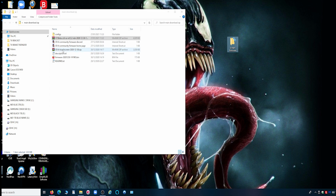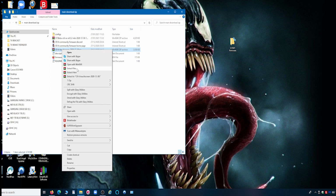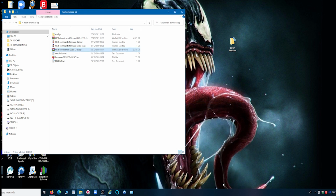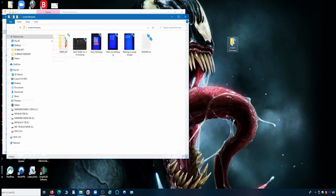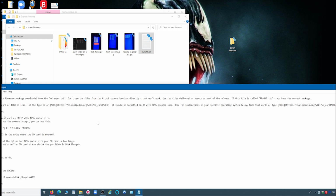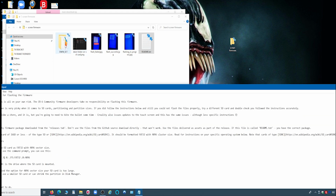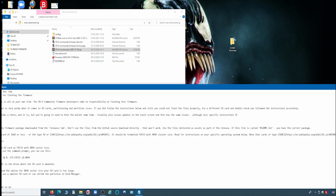So if we select the touchscreen one and tell it to unzip to there. Okay, so that should now be in there. So here are some pictures in here. There's a readme text there, and it goes through great instructions here. Here's just what I've been saying, the allocation size and FAT32, and tells you all about the size of cards, and there's loads of great info in there. And it's this thing here, the DWIN set, that entire folder that we drag onto the SD card for the screen, and it's this firmware bin that we drag onto the SD card